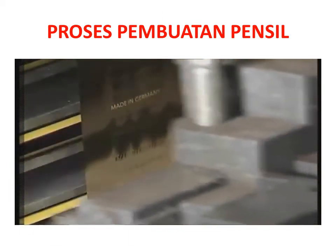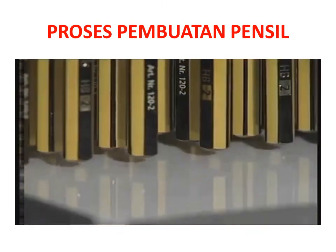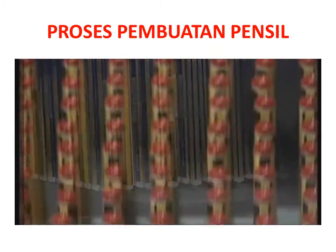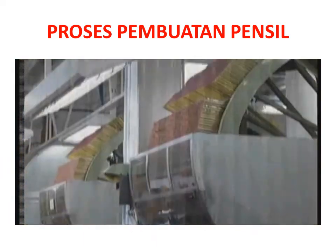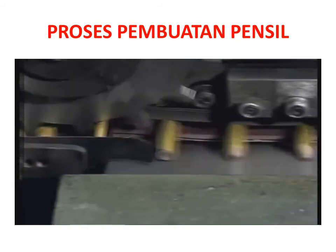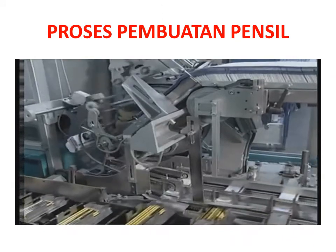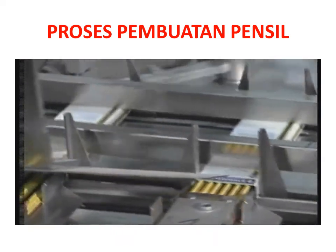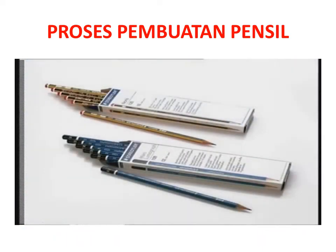The imprint is added by means of foil stamping. A final dip in a lacquer bath gives the pencils the distinguishing dipped end, a typical brand characteristic. The pencils are dried on giant wheels, then sharpened, packed and shipped to destinations all over the world. All of a top quality standard, of course. A series of meticulous, extensive controls, including numerous writing and sharpening tests and mechanical and chemical examinations, ensure that Staedtler pencils live up to Staedtler standards.